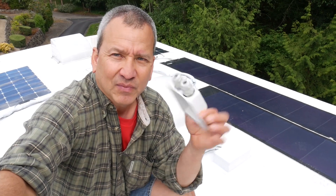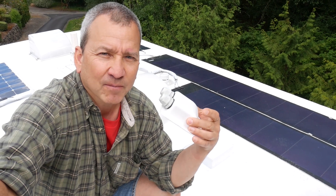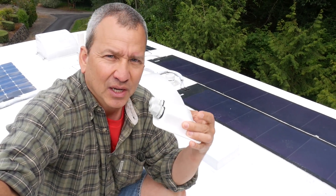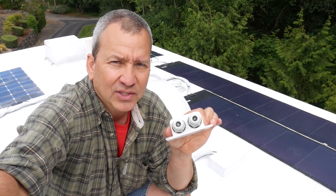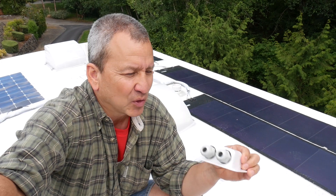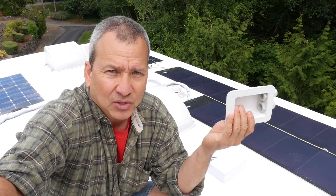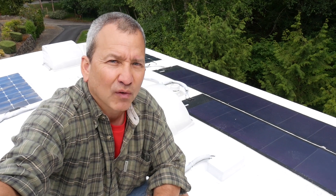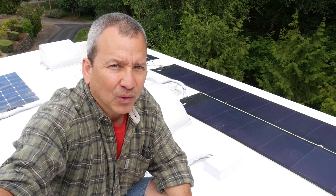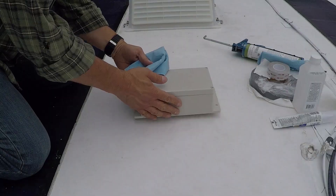I could have used a little solar access opening with cable glands, but I opted not to because it's kind of for a single application — you have two cable points you can run through, and that's it. If you wanted to run anything else, you'd have to totally take it off and replace it. So I decided to go with a larger box that I could add to over time, since I'm going to be adding more equipment on the roof and didn't want to create new holes or replace anything just to run additional cables.